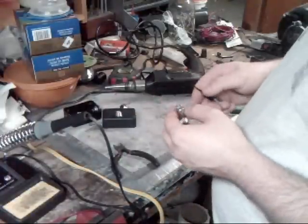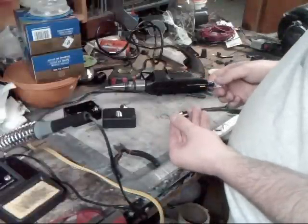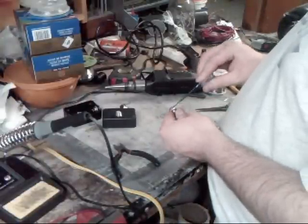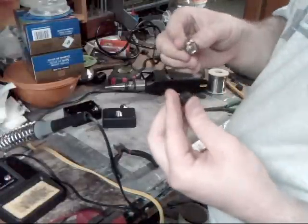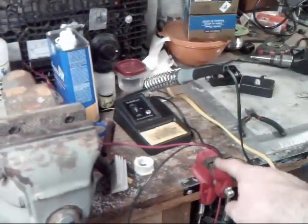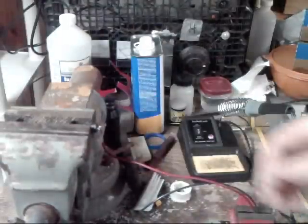You're going to need about 26 inches of wiring. 24 inches should be enough to stretch it from panel to panel — I just gave two inches extra. These connectors are real simple. Just take an eyeglass screwdriver and everything should separate. You usually have to twist and give a pull. Now you've got the two components. I've got a smaller vise here that holds the wiring so there's no tugging on this end. I'm going to anchor the end here in the vise, lightly.